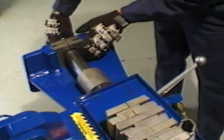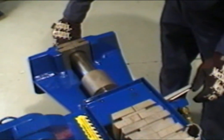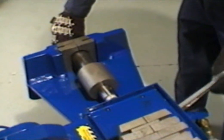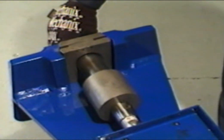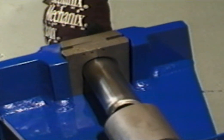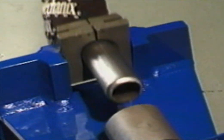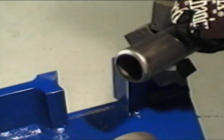Be sure to extend the tubing as far to the inside as is possible. Snug the collar back into the clamp blocks by gently pushing back on the collar assembly. Slowly move the tool forward until the desired finish is achieved. This procedure requires careful control. When finished, retract the die by lifting up on the control handle and return tools to the storage area.